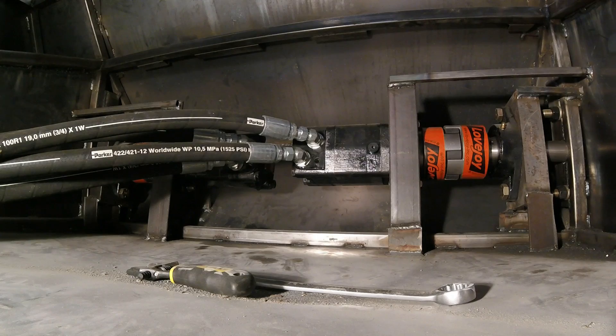They're connected to the sprockets on the outside through a Lovejoy coupling — the Lovejoy is an L150 series. The pump has a one-inch shaft, and then the axle shaft for the sprocket is an inch and a half shaft. Then just a couple of flange bearings to help keep everything lined up, supported, and keep it from rubbing as it spins.